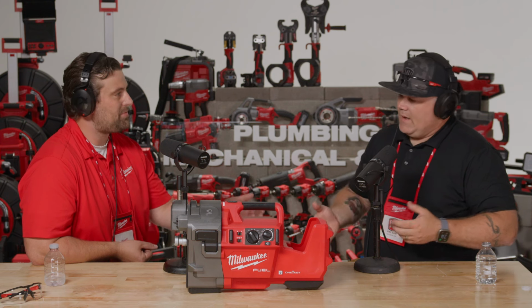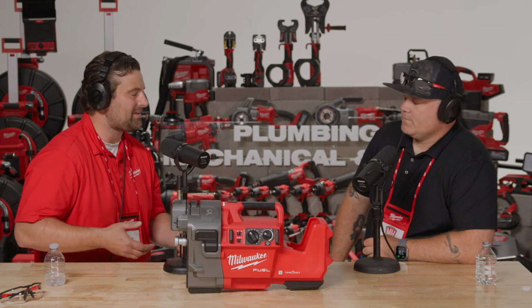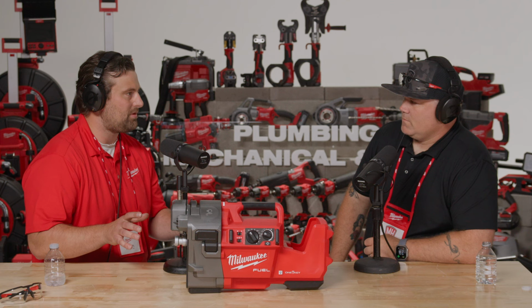Right. It could just be positioned on the tri stand on the vise. Yeah, that's one of the beautiful things. Before, you had all this fixturing going on and you're always spinning a pipe, and we saw a lot of guys holding on to the spinning pipe trying to keep it from walking or tracking. This eliminates all the hand inputs into the grooving process. So we like to say it eliminates the ratchet. You don't have a ratchet to index the tool. You don't have a ratchet to drive the tool. You're really keeping your hands away from that operation during the process.